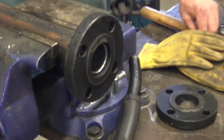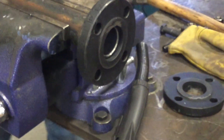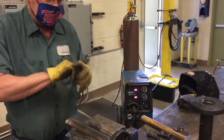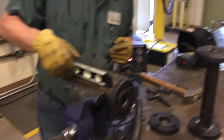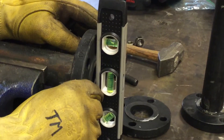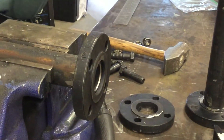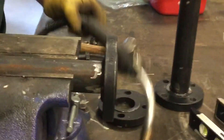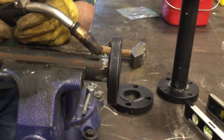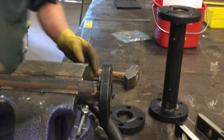At this point some people will start putting bolts in to get your two-hole close, but we can always change that as we go forward. I'm going to get my gloves on so when I go to tack I don't burn myself. I'll check my pipe again, then check the flange — we're going to plumb this to here. When you're doing your tacks, you don't want to put too big a tack on because it will pull the flange on you.